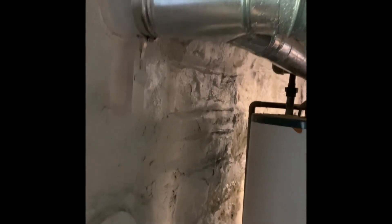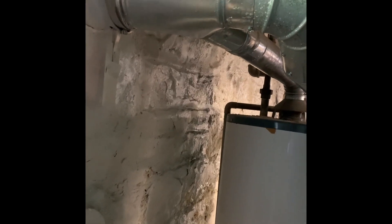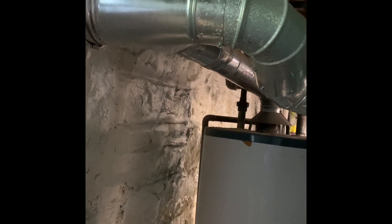Reworked the hatch. Flue already has a liner in place. We need to make sure we put a T fitting in there — we need a 5x4x3 T. The 4 drain goes over to the floor over there.